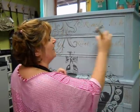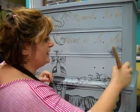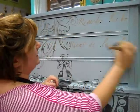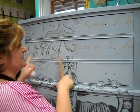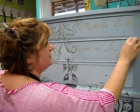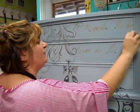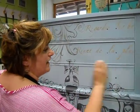I'm not sure if the camera can pick up on it — the wax doesn't change the color of the paint, but it intensifies it a bit. You would notice that this side is a little bit deeper in intensity than this side, and that's because this is where I just applied the wax. At this point, using a rag or a piece of cheesecloth, I'm just going to go ahead — I'm not buffing it, but I'm definitely pushing the wax in and removing the residual wax.